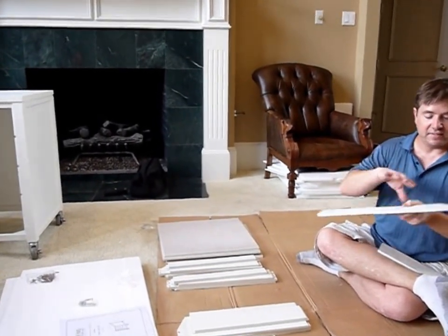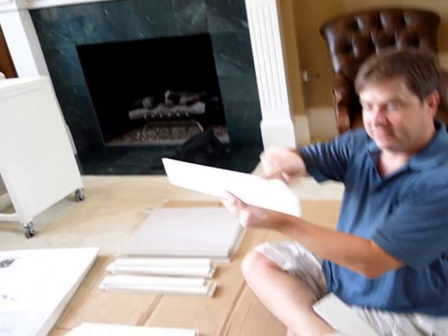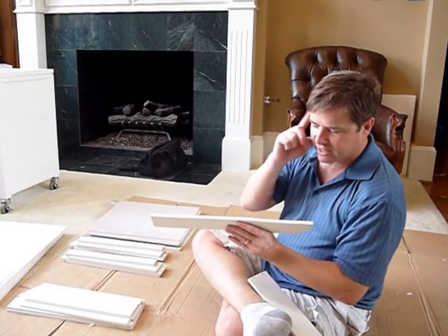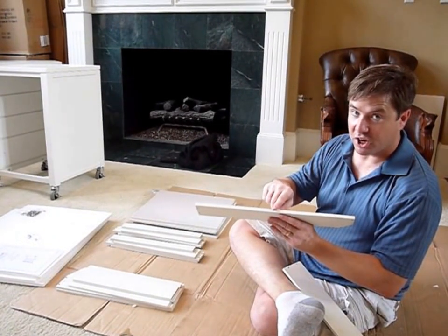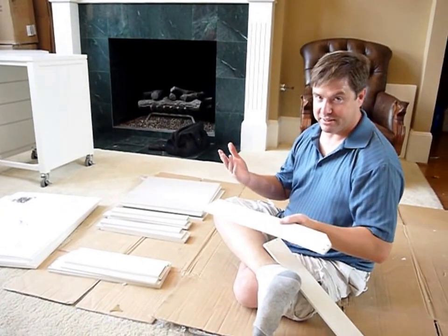Also notice that the front of the drawer is clearly defined by the angle cut, and the bottom of the drawer. This is the most important thing to always keep in mind and double check: you have little pre-drilled holes for securing the base, so you can always define where the bottom is. So you always make sure that you have your bottom in the right position.